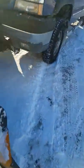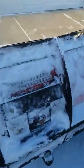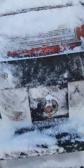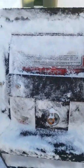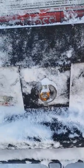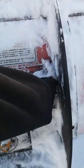What I did is they come with this big square washer to go on the back of the plow. I drilled the hole right through the poly and then put that on and kind of fitted where it went. It actually lined right up with this metal brace down here, so I just welded it right to that. Then I just cut a piece of strap metal to fit in between the braces of the plow and welded it to that.